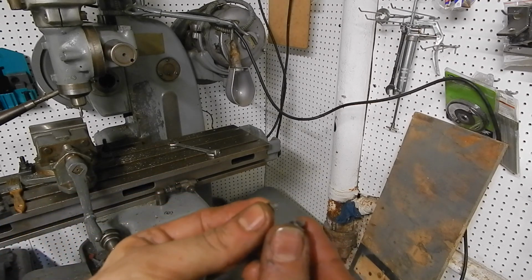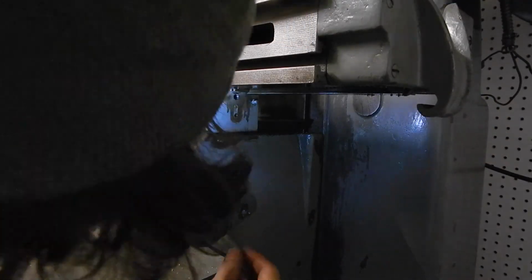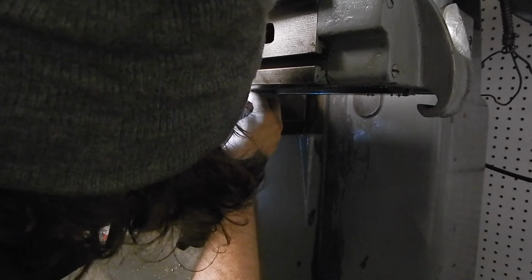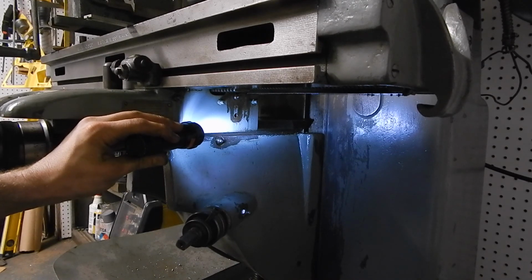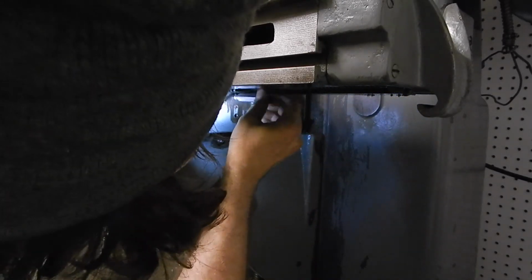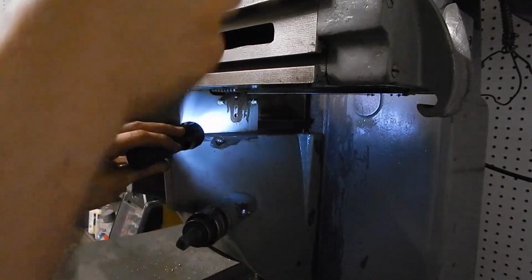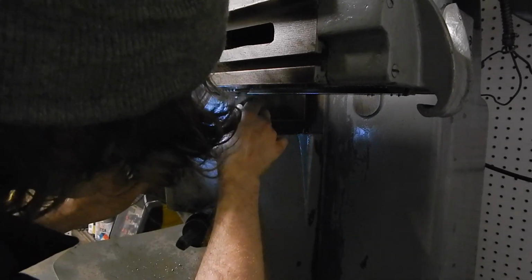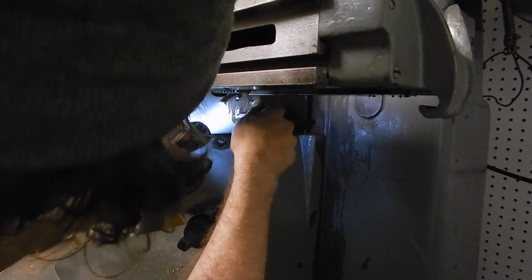In order to mark the screw hole locations for the mounting screws on this, we're going to use these Hyman transfer screws, and I'll show you how they go in. So the way these work, and I need 2 different ones, is the little carrying tube also has a driver at the tip of it. Now that little point is facing me, and when I put my part up against it, I'll just give it a tap, and it will make a mark precisely where it needs to be.